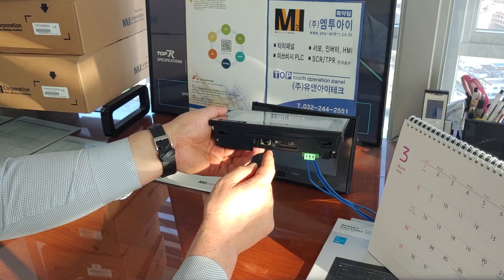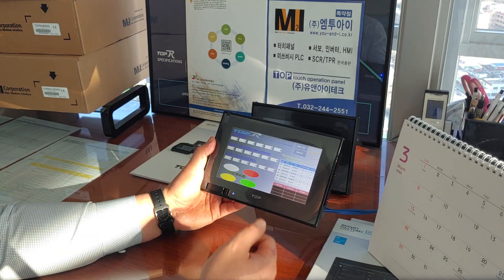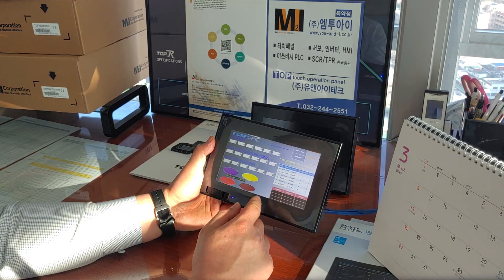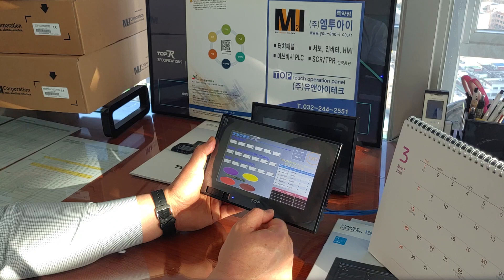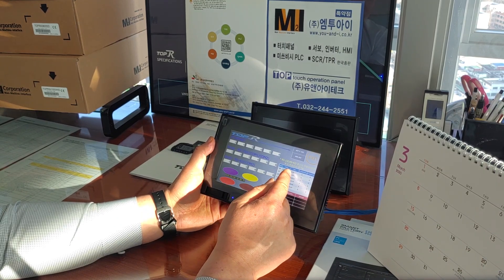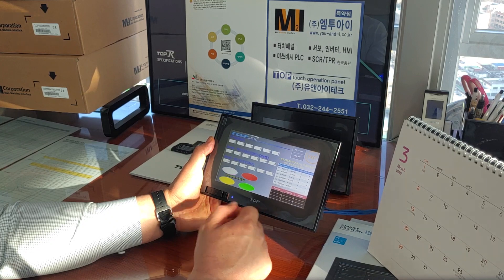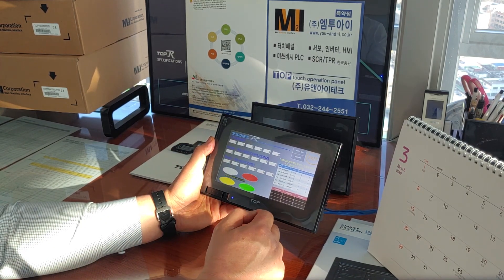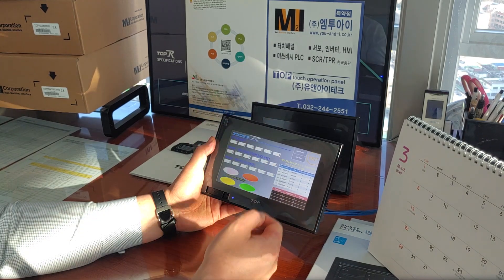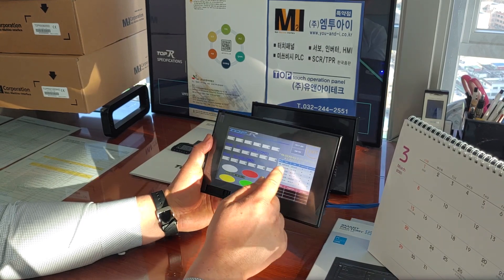Internet portal — this is to be connected but there's no communication at the moment, so it's all zero. But logging data and alarm records are shown here. When Ethernet or serial communication is connected, the logging data and alarm values increase every second.